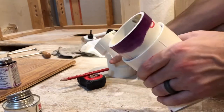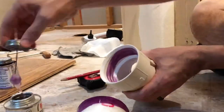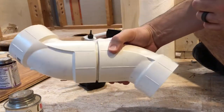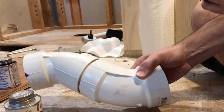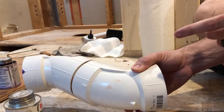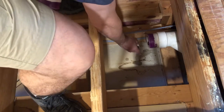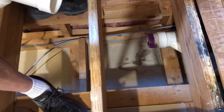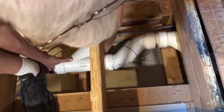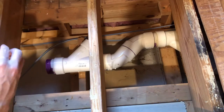I'm going to do the same thing on this side - just have to be careful to make sure my lines are lined up. A nice big fitting here that's going to let my 3-inch line jog over. Now I'm going to put together a second one of these for the other end, where it has to move back over into line with the other existing end. It looks like I missed a recording. I did go ahead and assemble the other two 45s, and I also already added to that a Y - a 3x3x3 Y that I'm going to use to capture the toilet drain. I'm also going to add another 3-inch Y for the shower and sink drain that's coming from the bottom of the screen.